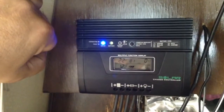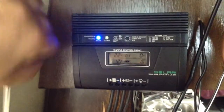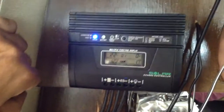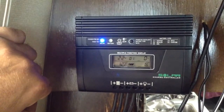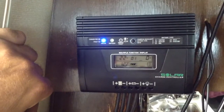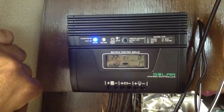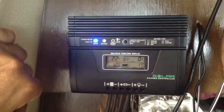This particular system right now has only 200 watts worth of panels. It's an overcast day, so I'm only getting 22 watts out of it. In theory, on a PWM charge controller like the NetMeter Solar models — which I personally like — they're still going to get power on a day like this, but it's hard to say how much.